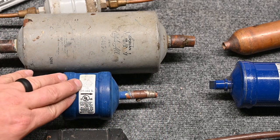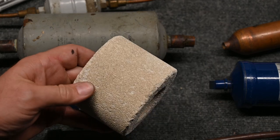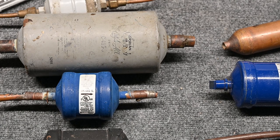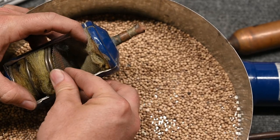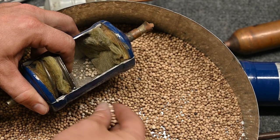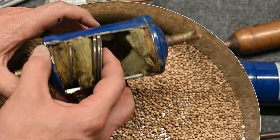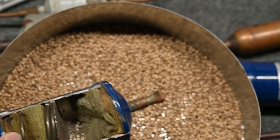The line size coming in, the direction of that filter dryer, and the capacity of that filter dryer are all very important. When you get a new filter dryer, a few more things we need to know. There is a solid core, and with a solid core you've got to be careful — if you drop it, it could crack the material. Other types of filter dryers use a type of loose BB style. This material fits up inside with a big spring that pushes against a little metal plate, and that metal plate pushes against the filter material. All these BBs fit up in here and the spring keeps the pressure on it, so the refrigerant has to travel through all the desiccant, which dries it. Some people like these because if you drop them they're not going to break — the spring absorbs the pressure.